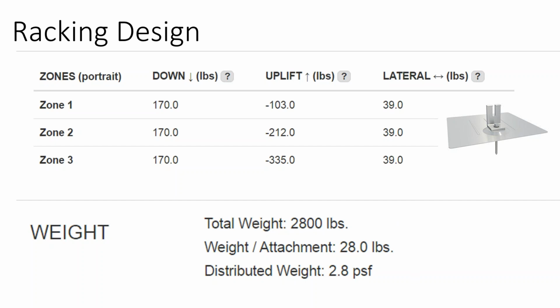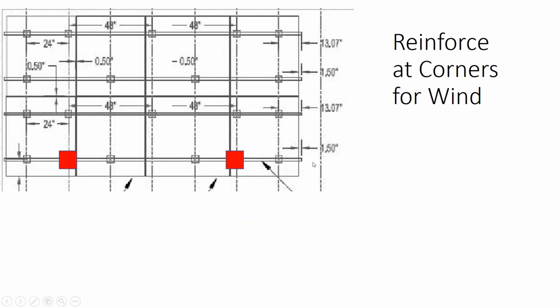Remember, it's really not the solar attachment that's going to leak. It's the pre-existing attachment penetrations that are surrounding the array that, in my experience, become the leaky points afterwards. A comp shingle rooftop is really not intended to be a retrofit construction work site. So there's always going to be some imperfections in a retrofit process.